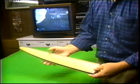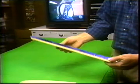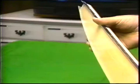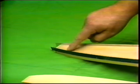So basically what I did, I took a piece of pine wood. This looks to be like a half inch or 5/8 inch thick. And I used a saw and a sander to get my curve to my platform, my flap. And then I used a piece of thin sheet metal to set up the thickness of the leading edge of my flap by having it tacked in with small brads on one side of my jig board. And then on the opposite side, if I wanted to have, let's say, an eighth of an inch thickness at the trailing edge, I just took that same piece of sheet metal, set it up so that it would be an eighth of an inch above the board, my jig board, and used some brads to nail that down.